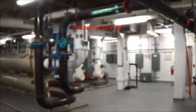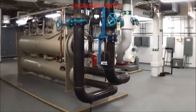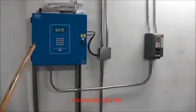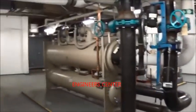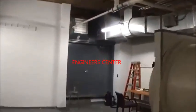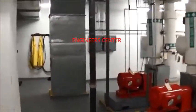Because these are new chillers, they use a new refrigerant which is not a benign chemical — it is toxic, as opposed to R11 refrigerant which was an ozone killer but not deadly. If we have a catastrophic refrigerant leak, we have a sophisticated detector here that constantly samples the air. It will lock down the chiller plant so no one can enter, turn on an emergency exhaust fan to evacuate the air to the atmosphere, and bring in a bundle of fresh air to replenish the space.